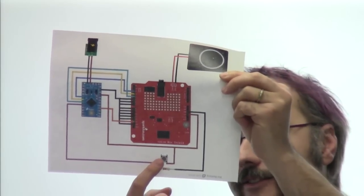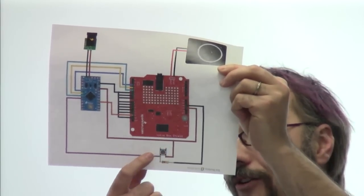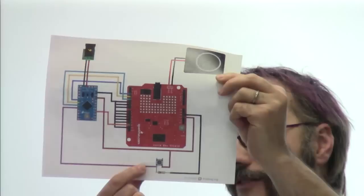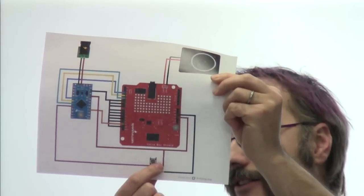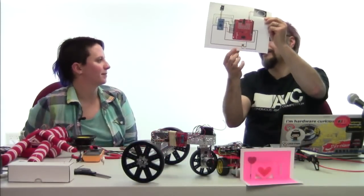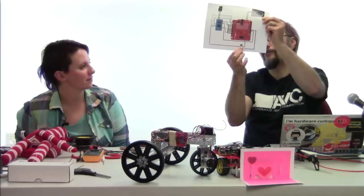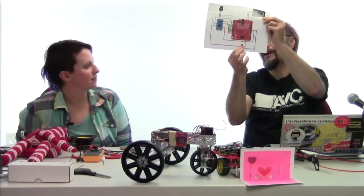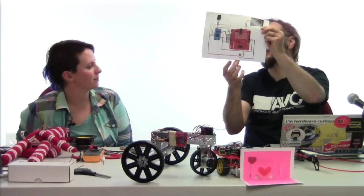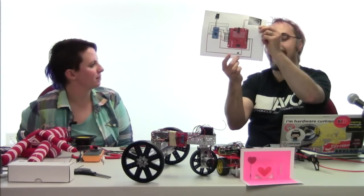What actually happened, if I'm getting this right, is that she has this third pin tied to the 5 volts and this over here tied to ground through the resistor. So when the button gets closed, it connects the pin here to the 5 volts, to ground through the 5 volts, and effectively is just causing a current to flow through that resistor, but the voltage is not actually going to drop.